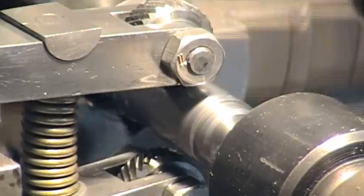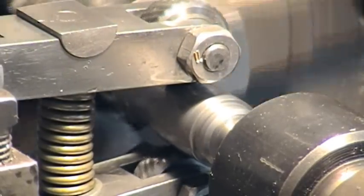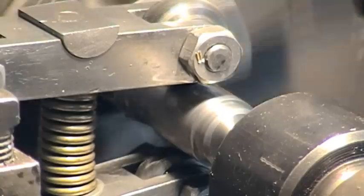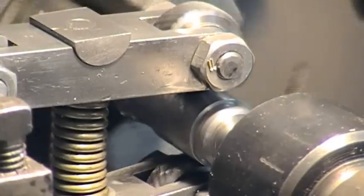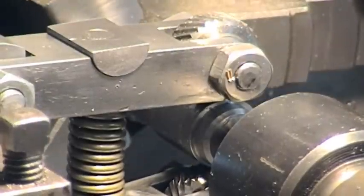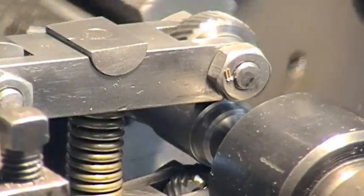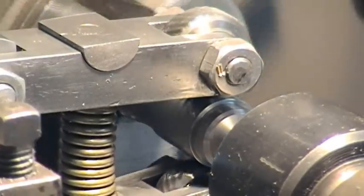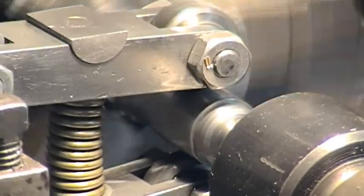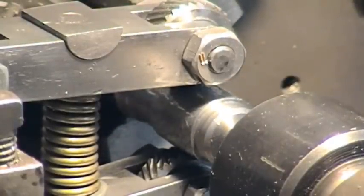We're getting close to center now; the top wheel you can see turning. I'm going to start to traverse whilst I rotate — I've got a very, very light bite at the moment. That's brought me to the other end. I'm going to increase the pressure and traverse back to where I just came from, using manual feed. This is actually easier on a larger work piece. Now we're beginning to get some pattern.